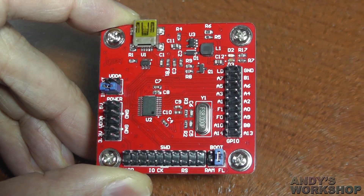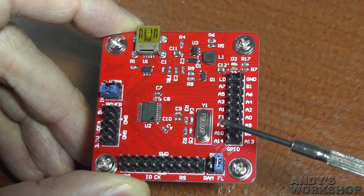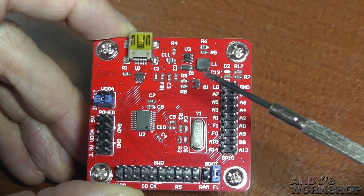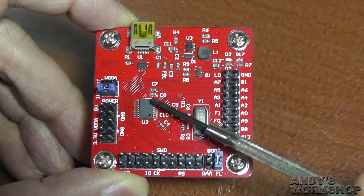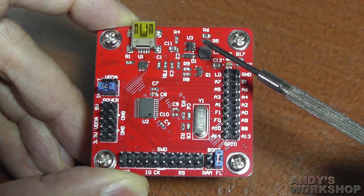That's just a handy quick reference to save you breaking out the reference manual every time you want to remember where the pins are. Here it is all built up and ready to go. The process I used to build this was basically three stages. I chose to reflow the larger parts using my reflow oven — my Android reflow oven that you can read about on my website. I tinned the pads, placed the ICs, did the ICs and the inductor — that's about it for the larger parts in the reflow oven.